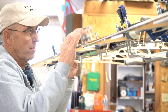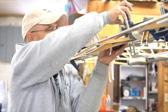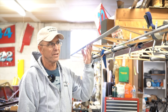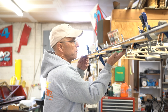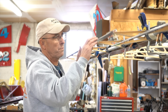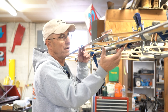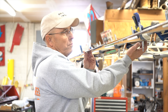I set the ailerons first with the flaps on loosely — you can just loosen the clamp a bit and move things. The book calls for 30 degrees up and 30 degrees down, and I've got that. That wound up being about an inch from the nose of my aileron to the back of the trailing edge on the bottom — so I've got plenty of clearance. It goes all the way up. In the past I've sometimes had to take material out of the top of the hinges, but going by those measurements — nine and a half inches on the aileron and 10 inches on the flaps — I get my full 30 degrees without messing with the hinge backs.